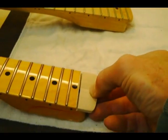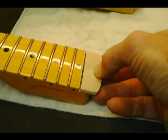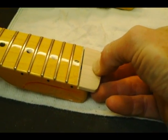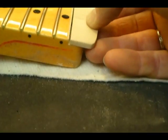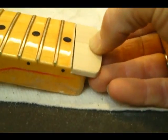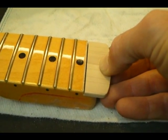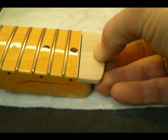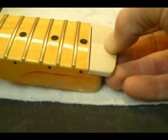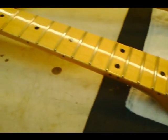So what I'm going to do now is start the finish process. Before I install that piece, I will make sure that the finish matches the rest of that neck. I'm going to attach that up, add the color to it, and then put most of the finish on there. I will add some more finish later on when I get that piece glued in there. And then we'll have a neck with a 22nd fret. I'm going to re-fret the entire fretboard too, by the way.